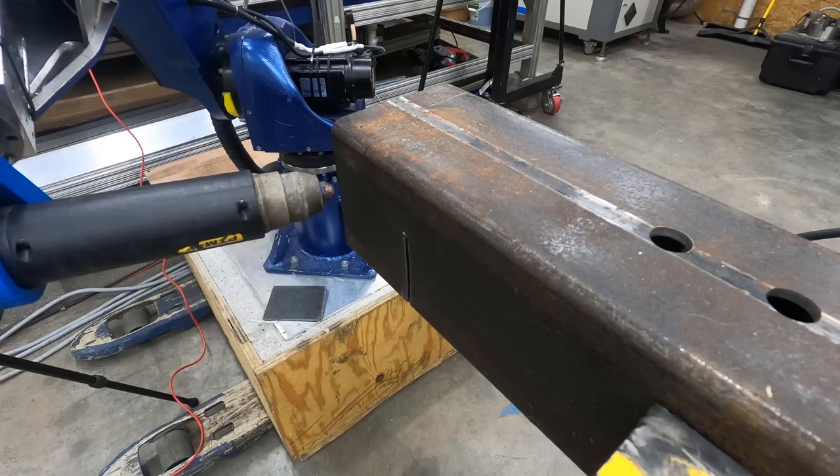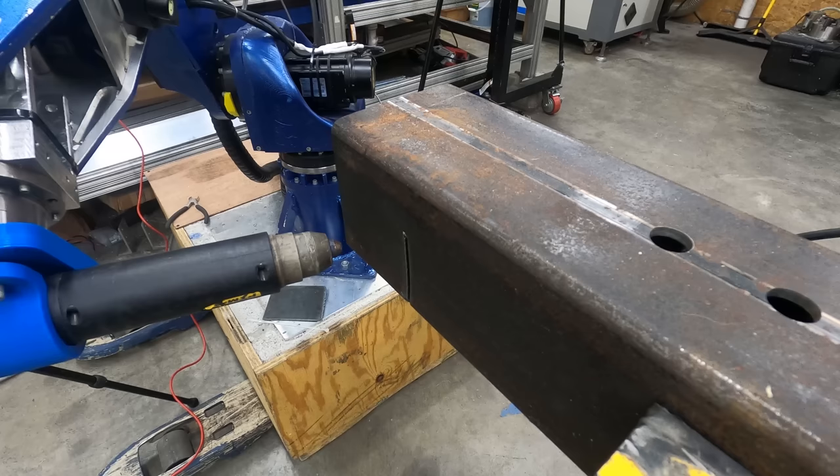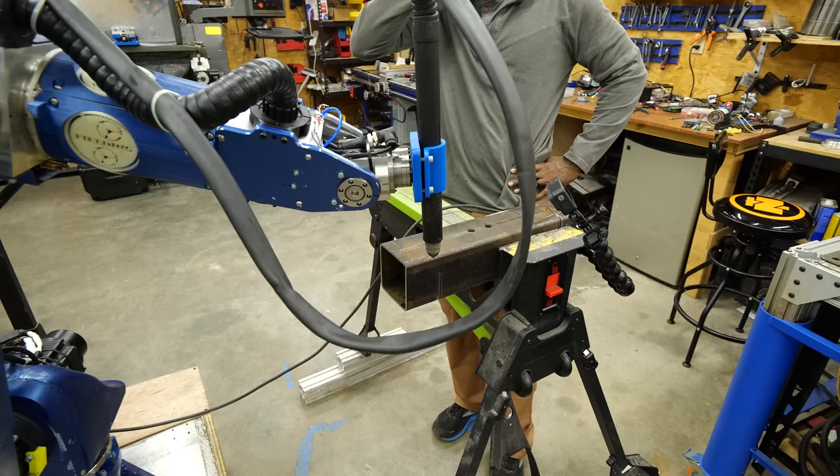That was awesome. Clearly something else is going on here — I am back out of position. Right now I am multiplying the number of steps being received by the servo controller by 25, which means as far as the Teensy is concerned, it takes 400 counts to go one full revolution. When I do joint moves it keeps going back to the same position, but with the linear moves, somewhere along the way it loses the position. And then you saw that behavior where it backed off of the part — which is the opposite of what I thought it should do. There's something else going on in the program that I haven't figured out yet, and I've just run out of time to investigate.